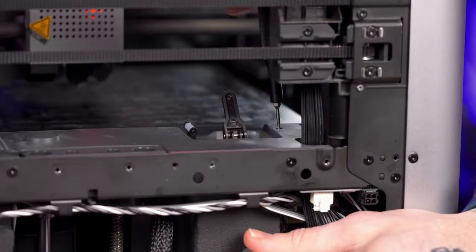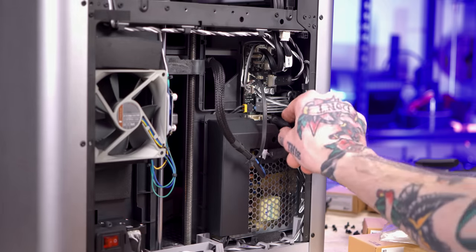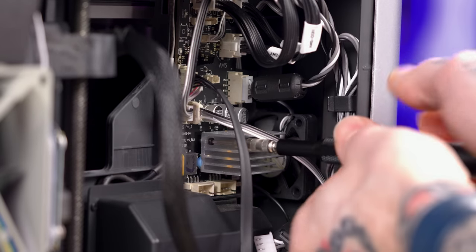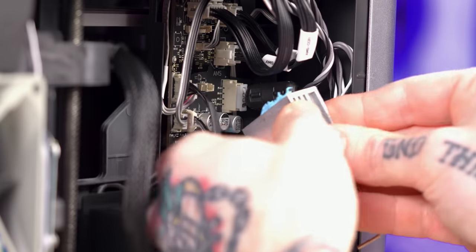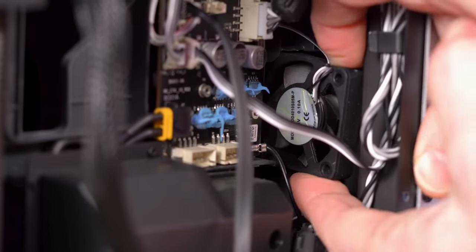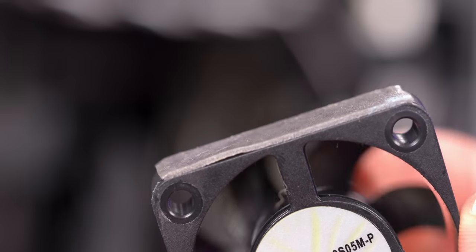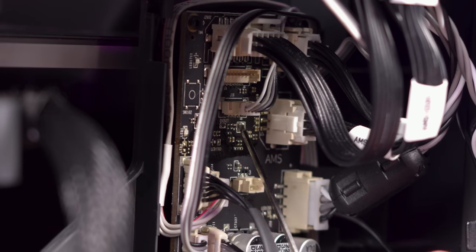We'll do a side-by-side sound comparison in a moment, but first I want to replace the main board fan. That means I need to remove the poop chute, followed by the motor connectors at the bottom of the main board, and then the heat sink that's over top of the motor drivers. This heat sink is kind of annoying to remove and it's slathered in thermal compound. Then we have access to wiggle the fan out of its cradle. The fan connector is up toward the top of the main board — just trace the wires to it, unplug it, and replace the fan.